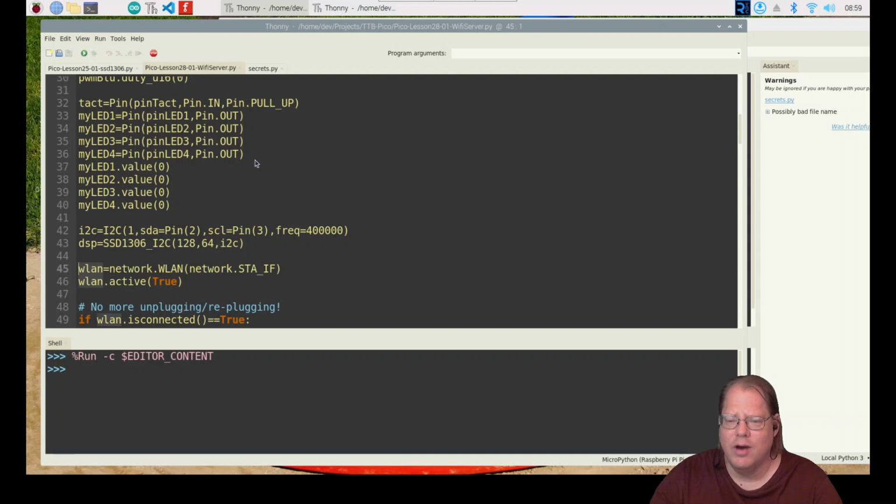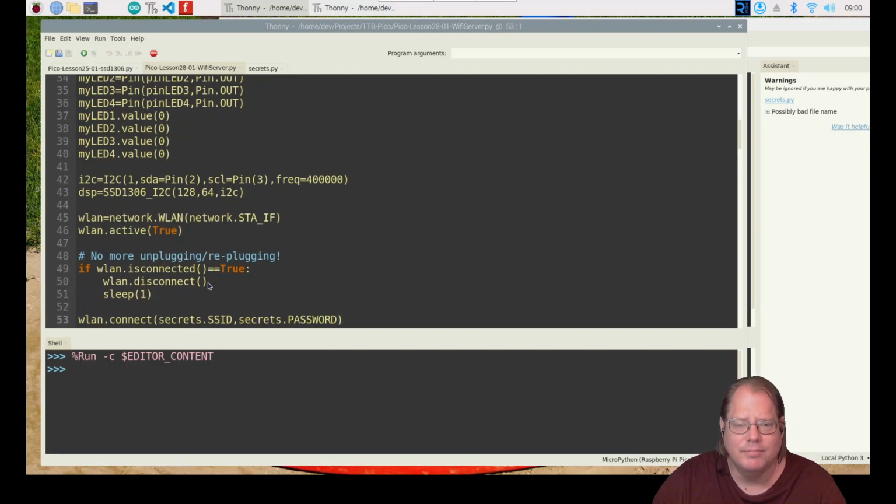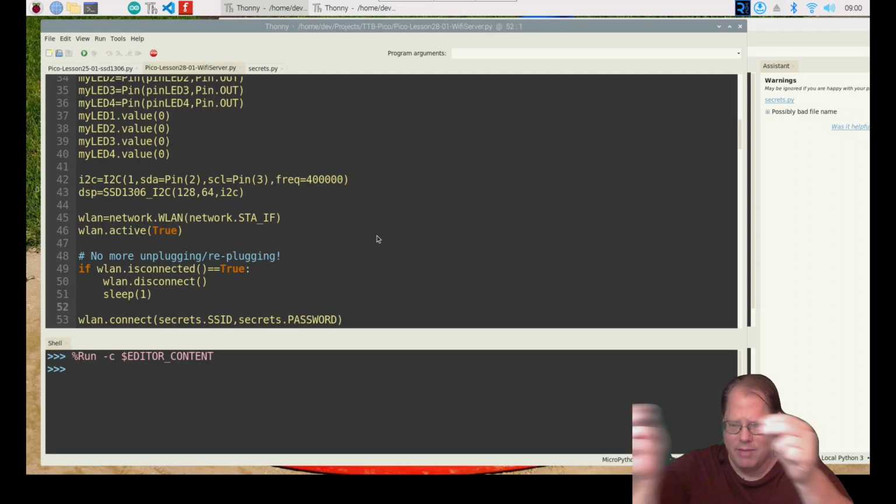Now we're going to get into all of the wireless configuration. So I want to make a point. This network WLAN function, there is a fantastic document on this function that I will link below. And it talks about all the different methods you can pass it. One of the functions is scan, which I know somebody was asking about building a Wi-Fi scanner with their Pico, and yes, you can do that. But the thing I really wanted to point out, because I know it's affecting a lot of people, is if you're running and testing the program over and over and over, eventually you're going to hit a point where it just won't connect to the Wi-Fi anymore, and you have to take that USB connector and unplug it and replug it to power cycle the Pico to get it to clear.